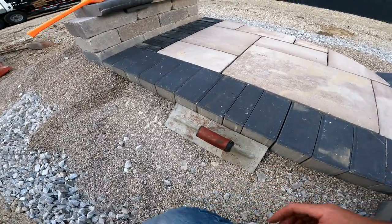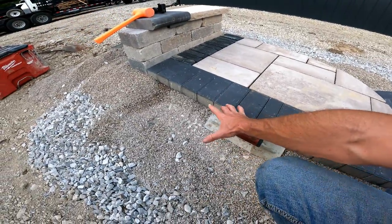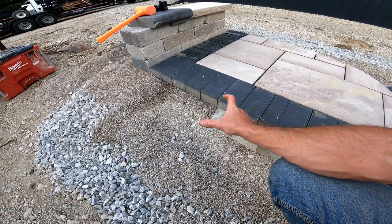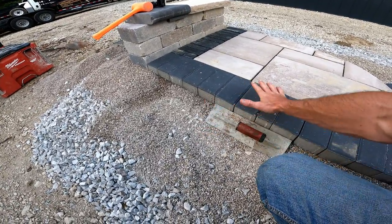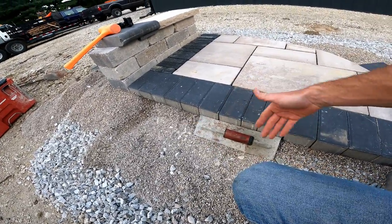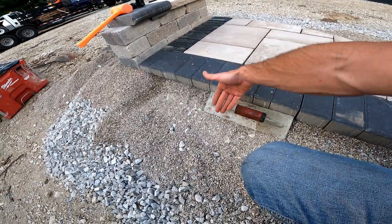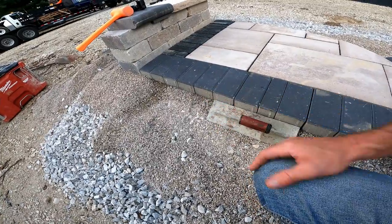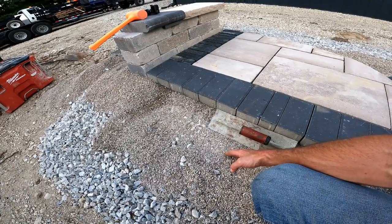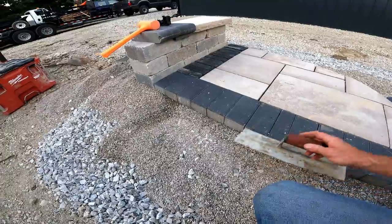We want concrete running about like that — you can kind of see there. The base extension should be four to six inches — whatever the thickness of your base is, that's your base extension. When you press down these pavers, it distributes the load down at a 45-degree angle all the way out, so we want that base extension there to distribute that load well. We don't want any more base extension than we have to have, but we've got to have that certain amount for a super strong paver system.